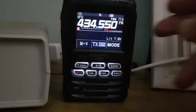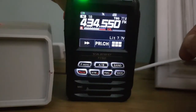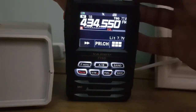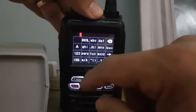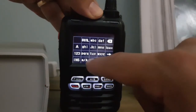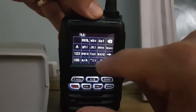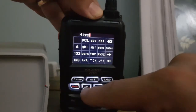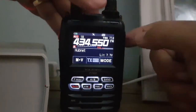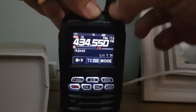Right, we're just going to show how to put it into memory — I know Steve so he won't mind. All you do is hold down VM, and you'll see that channel 18 is flashing — it's white, which means you can use that channel. If you click one back with the channel changer it goes red, that's no good — you want a blank one. So on 18, hit VM again and now you can name it. We're going to name it hubnet. Keep pushing where the H is until it gets big, then U, B, N, E — use the arrow across if you have to — and then T. Hubnet. Then hold VM one more time and you've got hubnet in there.